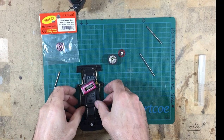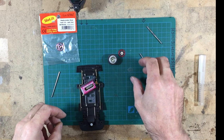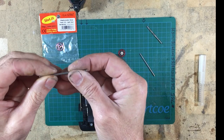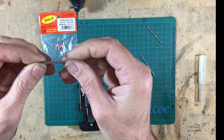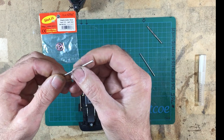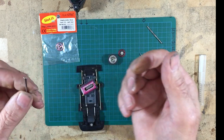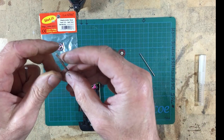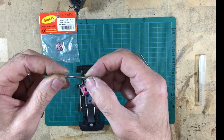So, enjoy! Okay, so I've run into a small hiccup that I've had to correct, but first of all, I'll give you some numbers. Now, a lot of slot car axles are 2.38mm. Now, to the new beginner, that seems like a very weird size, 2.38. Well, what is 2.38 and why is it 2.38? Well, quite simply, it's Imperial for 3/32.